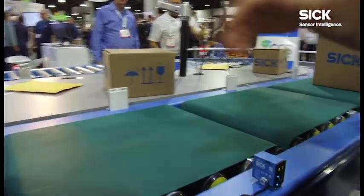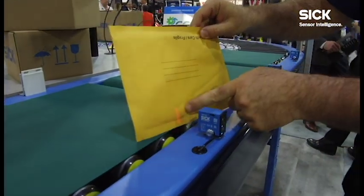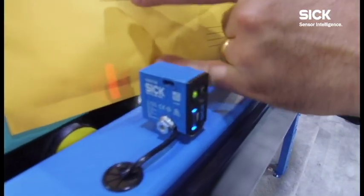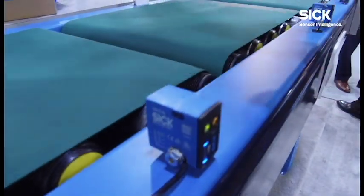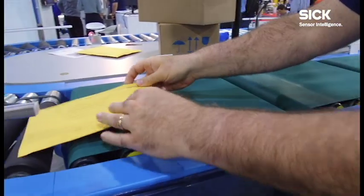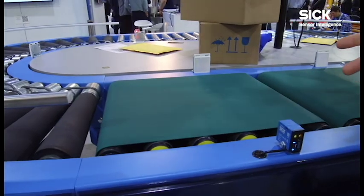The star of our show here is called the Ray 10. The Ray 10 shoots out a beam of light that is an array, and anywhere within this 12mm beam will be able to break the signal. This is great for items like poly bags that you wouldn't be able to sense with a discrete photo-eye.